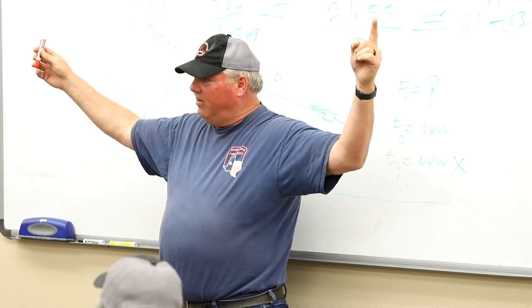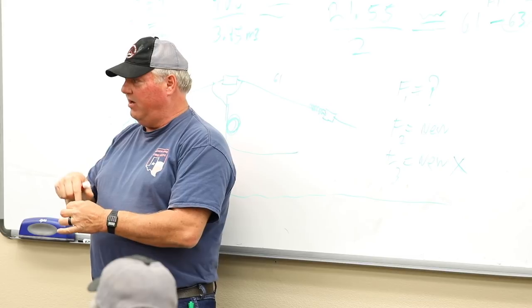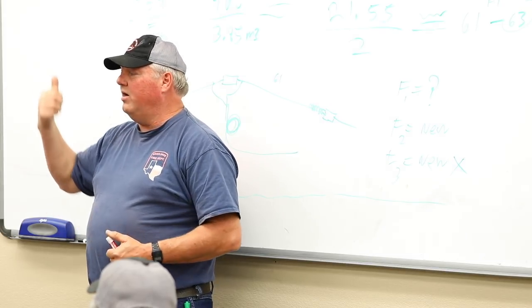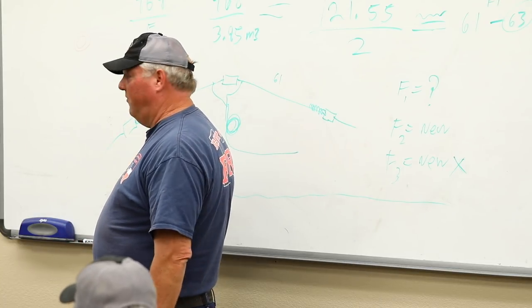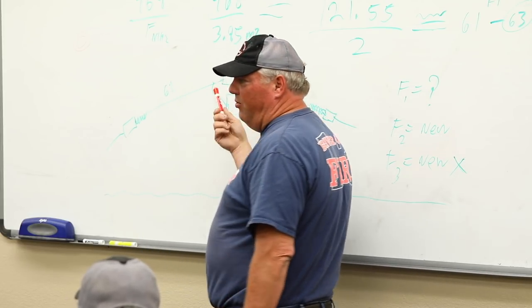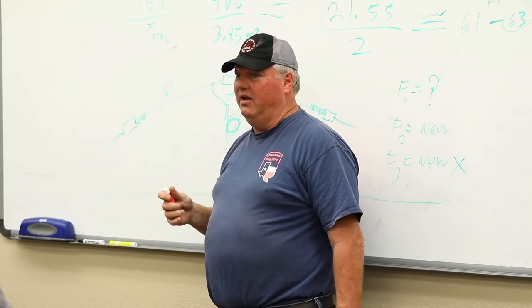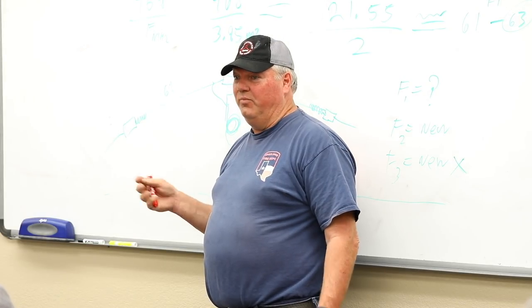And then the top, my tallest one, I took another piece, I went down to 3/4 inch EMT, and I went to 1 inch and 3/4. I wanted to get to 40 feet. So this is 40 feet. So I'm 1/4 wavelength all the way at 40 meters on the ends, and on the center feed point, I'm really close to 1/4 wavelength on 80 meters. And yeah, it did. It was weird. My receive got better. I can't explain it.